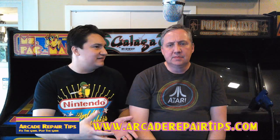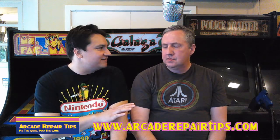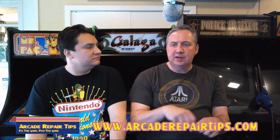And we'll talk about his chassis here in a second because he says he has the same chassis that we have in our video on the horizontal width coil. But just in general, any good ideas on trying to adjust a horizontal width coil that's being a little temperamental? Well, you mentioned already, sometimes you have to take it out. Right. And you can spray it with silicone, WD-40, try to loosen it up, rinse it with soap and water.